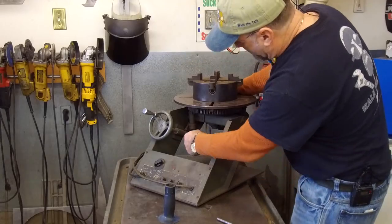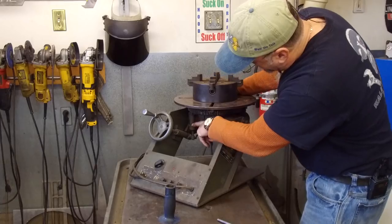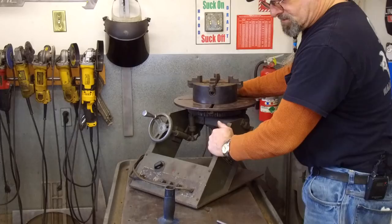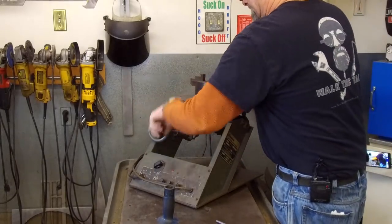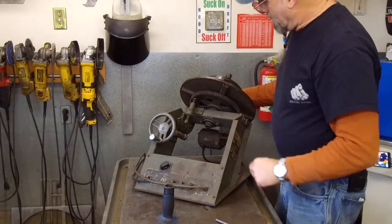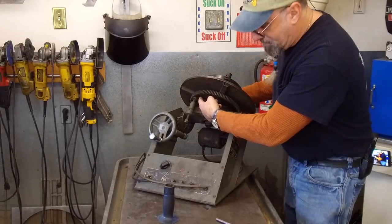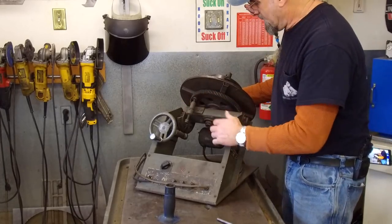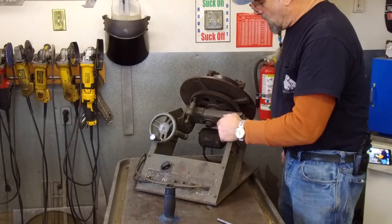The other thing that's real simple on here is just a spring-loaded plunger and a piece of pipe right here with a braided ground strap. That flat face just touches the back of that gear right there. That's what it sounds like with no oil. So on that little flat foot up here, I put anti-splatter lube, MIG nozzle lube, and it works really good so that when you rotate this around, it doesn't squeal at that point.